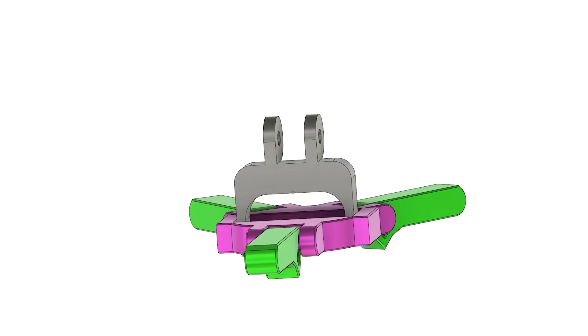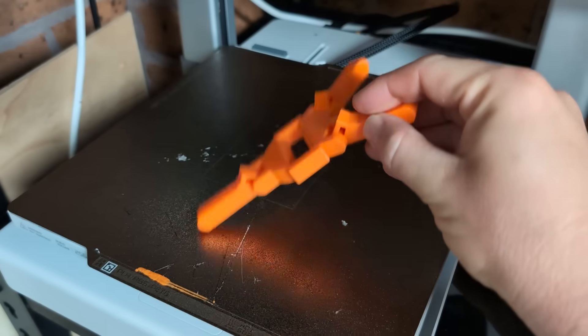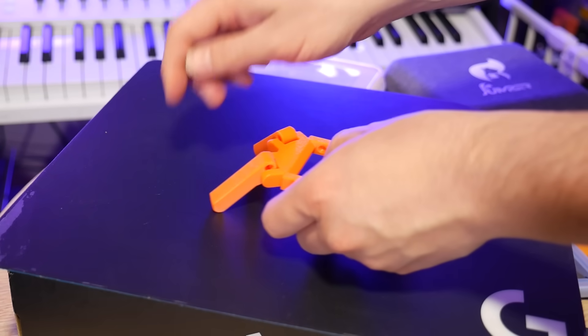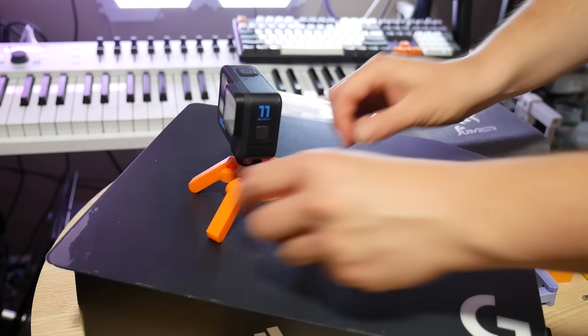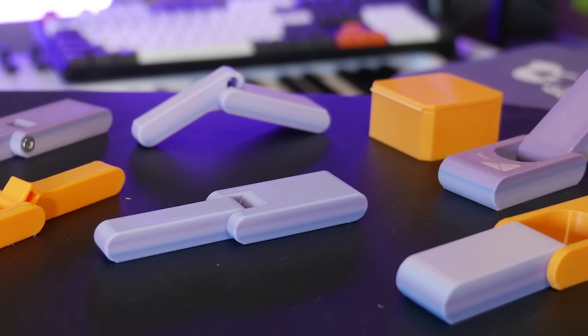To demonstrate just what you can do with 3D printed hinges, I designed this: a folding GoPro stand, which incorporates several of the hinge designs I've talked about in this video. The legs are designed with integrated print-in-place butt hinges that have that locking detail, so when you move them into position, they lock in place, holding the stand up. It's not the most practical GoPro stand, but considering the whole thing is 3D printed, I think it's pretty neat. With a bit of careful design work, you really can design awesome articulated things for 3D printing. I'd love to hear how you use 3D printed hinges in your projects in the comments below. In the description, you can find links to all of the hinges shown in this video, as well as links to Micro Center's Black Friday deals.